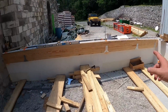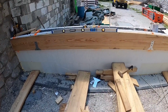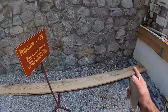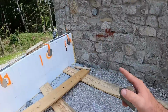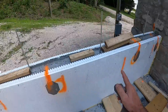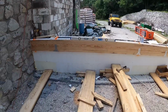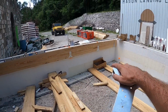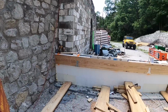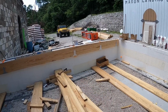All right, you all saw me install four of those brackets on time lapse there, but I wanted to give you guys a really good explanation as to what this is actually doing. Behind that 2x12, if you guys remember, we have all these octagon plates. I did go through and spray me a center point line, because once I put the 2x12 up there, I can no longer see that octagon plate. I also screwed a short 2x4 on that end and a short 2x4 on this end, simply to hold the board at elevation until I got one regular screw in the center screwed to the stud,